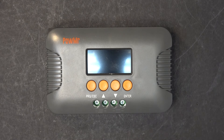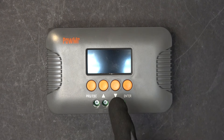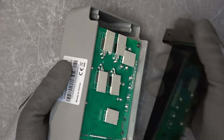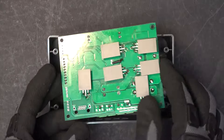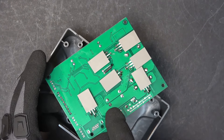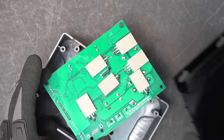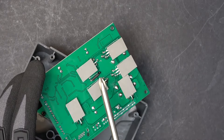It's time for a teardown — I'm going to show you what's inside this unit. There is one thing about this unit you definitely want to know if you own one of these. Remove the four screws on the back and you can pull the heatsink out. Then four more screws and the circuit board comes out. There are six MOSFETs here on the back of the unit — if you have problems with the unit, it's most likely a problem with these MOSFETs, because they are the main source of heat connected to the heatsink. There is also a small temperature sensor right here.